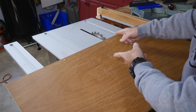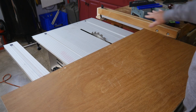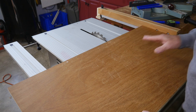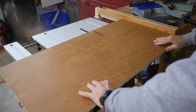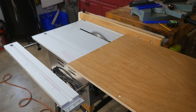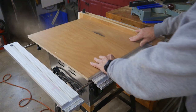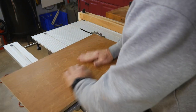Okay, are we ready? We're going to cut this. I've got my good old TacLife fence with the whole thing extended out because it's a fairly large board — in some of my previous saws this would have been a very difficult cut. We're going to do 13 and a half inches. Okay, so there — this is going to be our sled.